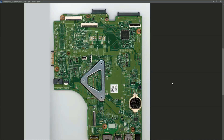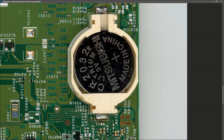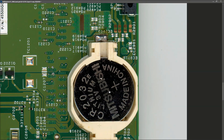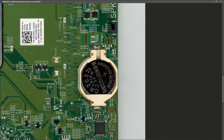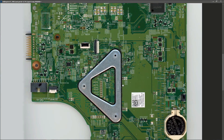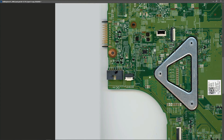This is what that motherboard looks like. I did a quick visual inspection and couldn't see anything really, bar one thing that had me curious — it looks like somebody soldered out the BIOS battery for some reason. I can't imagine why you'd do that unless you wanted to use it in another motherboard. So somebody has done work on this before, which makes it harder to fix. I'm going to start by injecting voltage into the DC jack since we don't have an adapter.